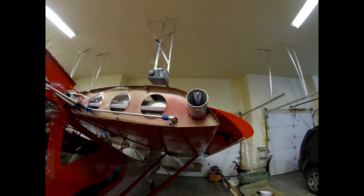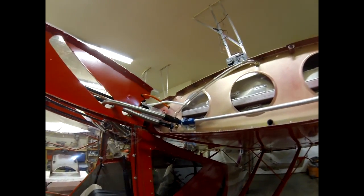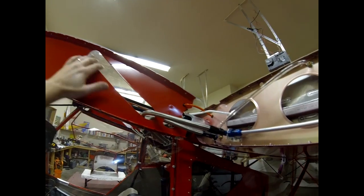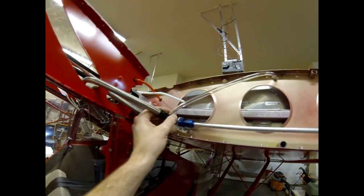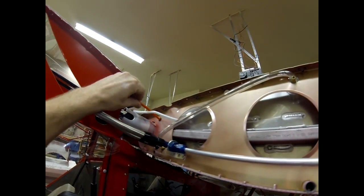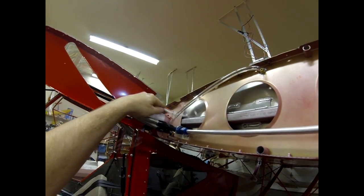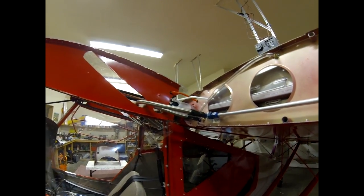Going around the wing — this is the install I've done on the front and rear pickups. I've used all AN fittings here. I had to slot the hole; this is the slot for the visual on the fuel, and I made an effort to use the same slot for the other fitting for the front pickup on the tank. That seems to work fine. Everything's clear. There's also the outside air temperature probe here — I had to run it through because I wasn't going to unwire it at the front end to put it through a hole. So that gives you a good idea of how the actual wing root looks.